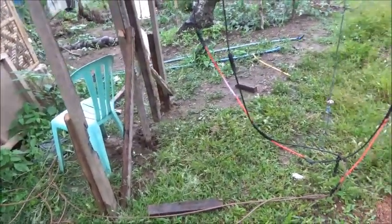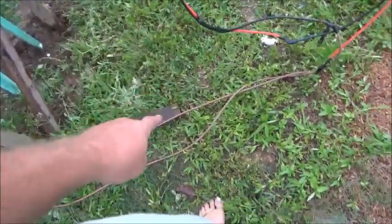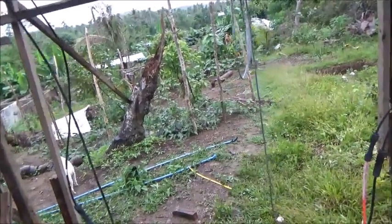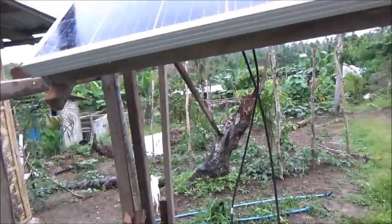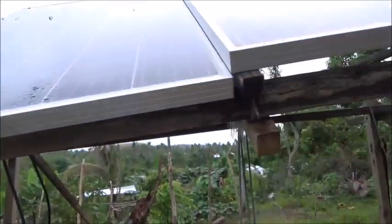I haven't gotten to them yet, but people were leaving a lot of comments, because I had mentioned there was a wire that was not really hot to the touch, but it was, you know, toasty. And it wasn't these cables coming out. It was actually one of these factory wires from the solar panel, and it was pretty warm to the touch, but as far as I can tell, they're aluminum, and even though they're pretty thick gauge aluminum, they're still aluminum, so there is impedance there, but I'm not going to rewire these panels. I'm not going to rewire them from their factory. I don't want to get into that. Don't want to open up that can of worms. So there it is.